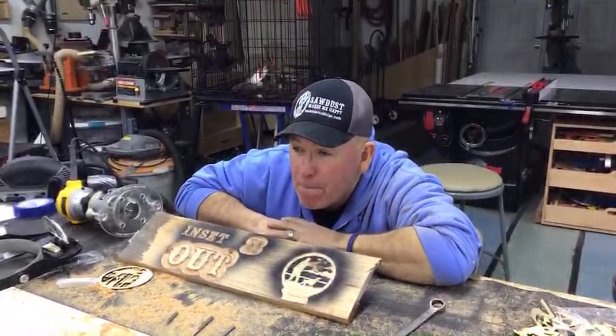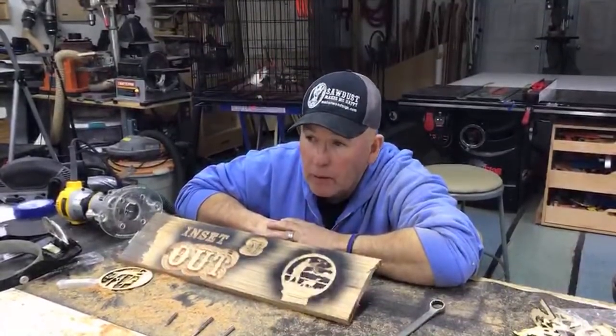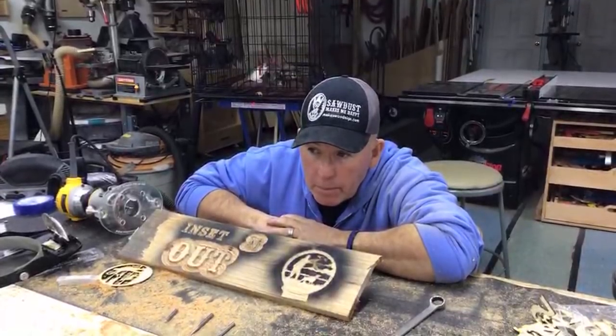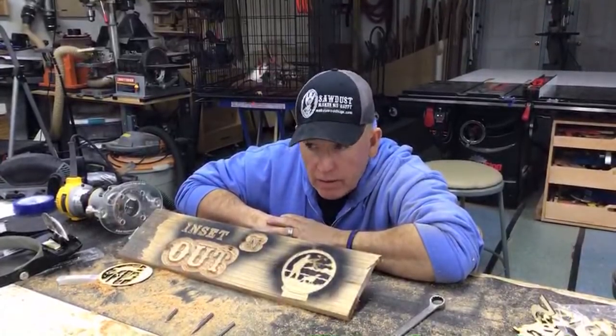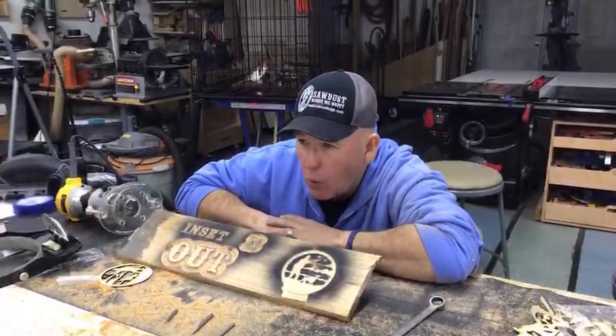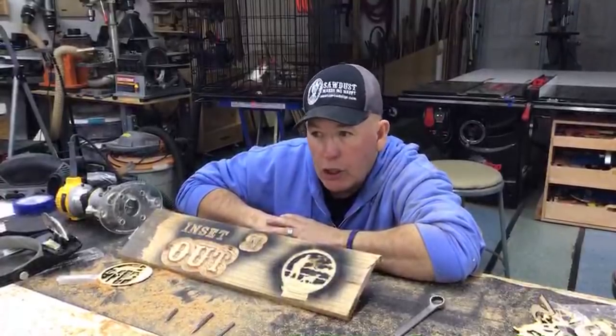You could sharpen your own bits. What are you sharpening carbide bits with? A diamond wheel. We've got a bench grinder with a diamond wheel. Do you just do the inside of the flute, or do you change the profile? We do the outside of the flute because there's no way to get in there. That's why I'm asking. I couldn't imagine. Yeah, no, there's no way.